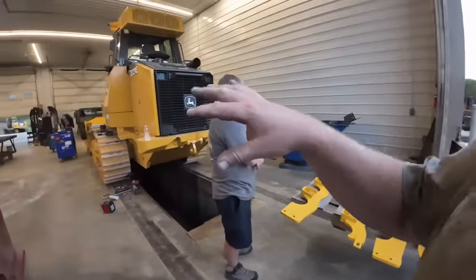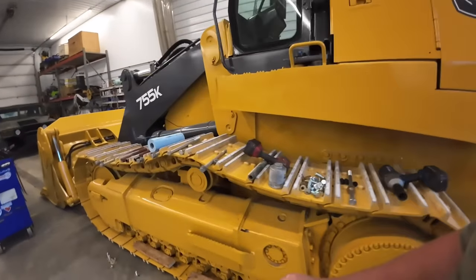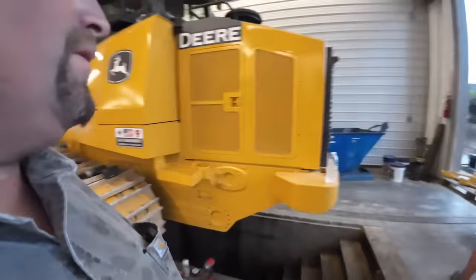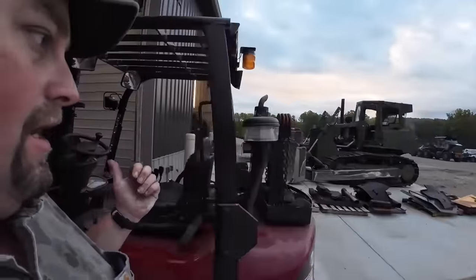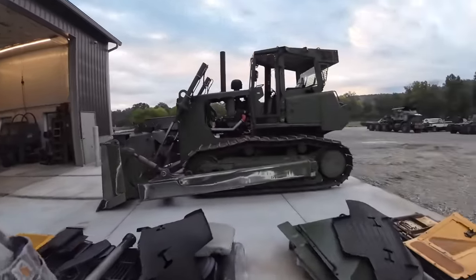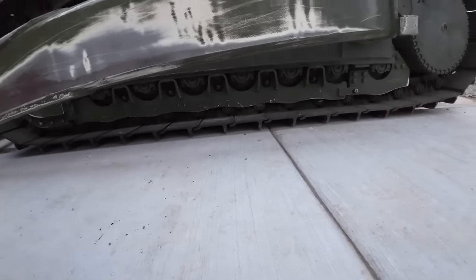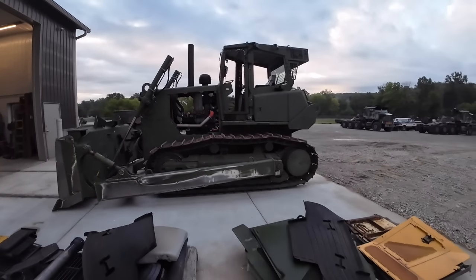Yeah. So our plan is we're gonna throw the outsides on first, and then we've got these big long through bolts that go through here with the spacer. You guys notice these are green. I don't know if I said this earlier in the video, the ones that we're gonna try to modify actually come off one of these 850J dozers. You guys know, you've been watching my channel, 755K and the 850s are pretty much the same machine. We thought we could just use these rock guards off these, but turned out the roller spacing was a little bit different. So that's where those green ones come from that you guys seen earlier. So anyway, it was all a good idea until it didn't work.